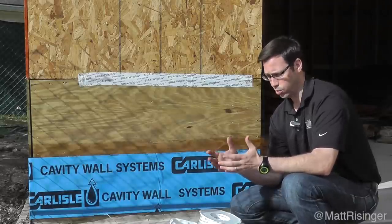I've done a lot of videos on various methods for air sealing, but I've become more and more convinced that as a company I need to ratchet my standard down — similarly but not quite as far as the passive house standards, which is a German standard for air tightness. My company goal is to take us down to about 1 ACH50. Code here in Texas is currently 5 ACH50 with the new international energy codes. So we're taking this quite a bit further than code requires, and in the past I've utilized various methods for air sealing, but most of that has been interior to the house.